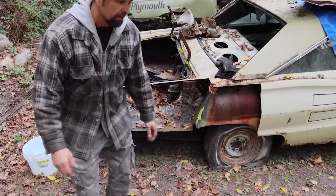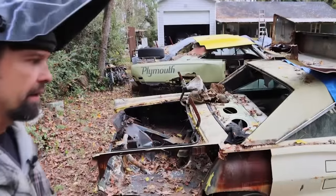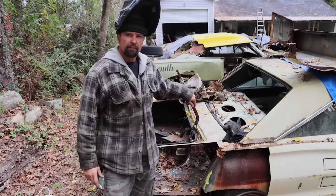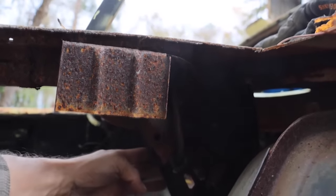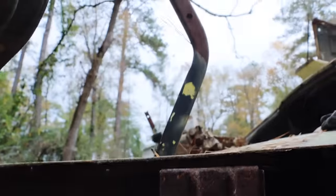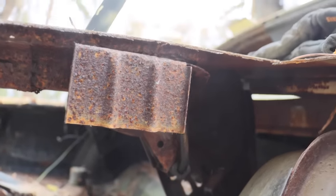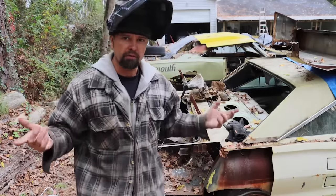There's a lot of rust in it and the front end is cut off. Don't get sad, don't get mad — I would never do that to any of these cars unless they're just absolutely roach like this. So this is the bracket I need for the trunk. On the street freak car, this is all worn out — the spring's really flopping around which is making the trunk bracket just flop. What I'm going to do is drill it out nice on that one, but on this one we'll just take the torches and cut this out, then clean up what we need back in the shop. I have a bucket of water — I don't want to start any fires back here. Next thing you know you get smoke and fires, which ain't good for me. So let me blow it off, throw some water around it, and let's get the torches out.